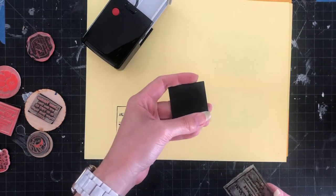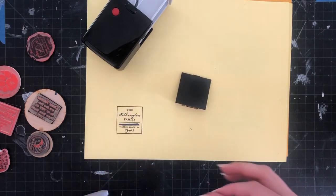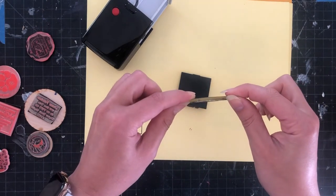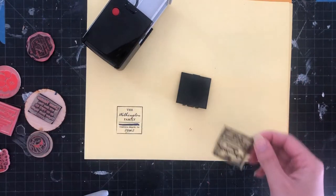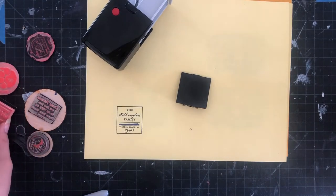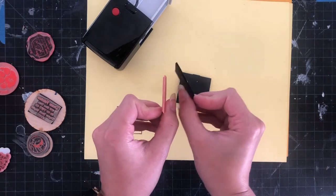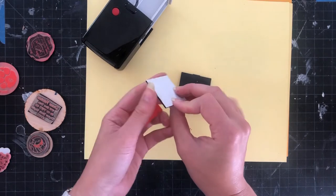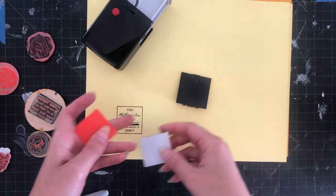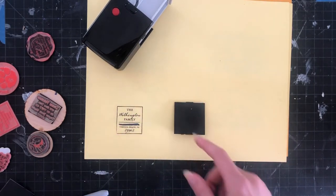You should have a nice smooth surface here. If you don't, just use some Goo Gone or whatever you have to remove that. Based on the height of the stamp — which may vary — I use my calipers to figure out the height. It works out to be the exact thickness of the stamping rubber that I normally use in one piece of foam. This is self-adhesive foam with a sticky side, and you'd just reapply this to the carriage plate.